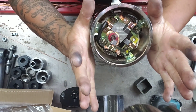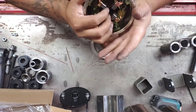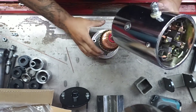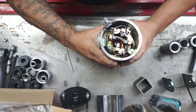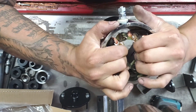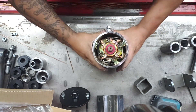Put your palms in here — it's not going to fall. Use your palms on the casing, push each brush back individually with your four fingers, and make sure the armature is directly below the motor so you can drop it straight in in one smooth motion. You can see I've got my four fingers in there pushing each one back — then just drop it right on and release. It looks easy because we've been doing this forever.